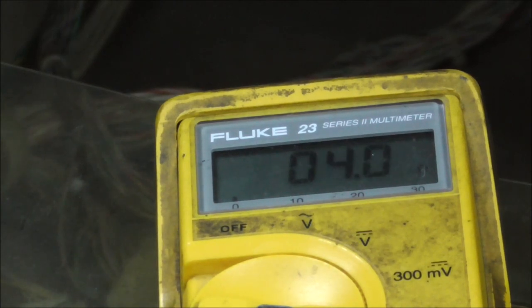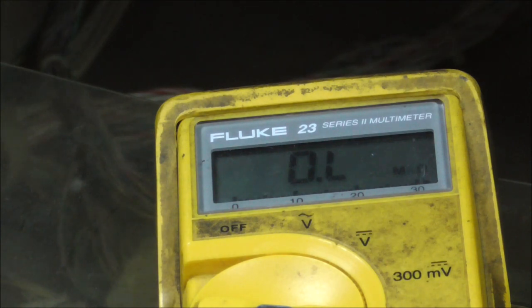So normally whenever you're blowing fuses, it's because either the coils just completely burn up or that end of stroke switch isn't working right. So on this particular one, the end of stroke switch isn't working right. So we've got to figure out what the problem is with it and just see what we're looking at.